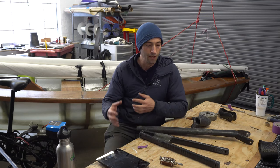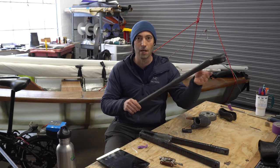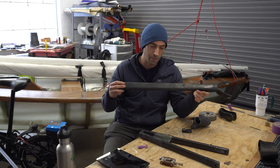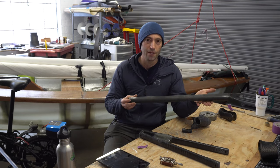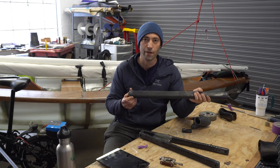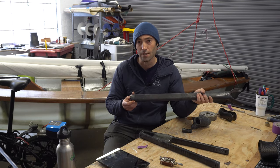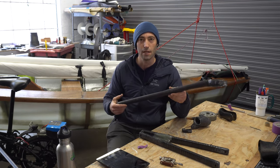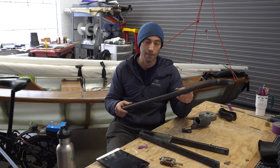So if you take a nice piece of wood that's strong, like vertical grain Douglas fir that I purchased here in the East Bay from McBeath down the block, then you cover that with maybe four layers on a piece like this, or maybe five, something like that is probably what I did. Then you end up with an extremely strong bar that is similar in strength to maybe steel that has a 16th inch or an 8th inch wall. So that's cool because it's probably a little bit lighter than the steel would have been.